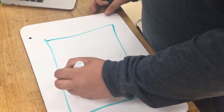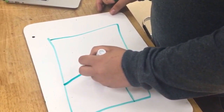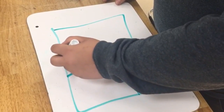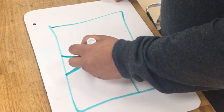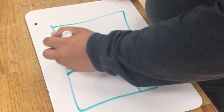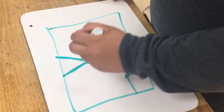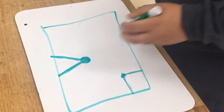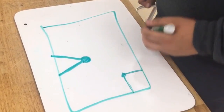So next we're going to do a V-shape, which is a diagonal here, and you take that out, and then you do a diagonal here, and again, pulling the blade back so that it doesn't stay in there. They're going to meet in this little point here, and that's going to pop the V out, giving you a triangular piece and a V inside the wood.